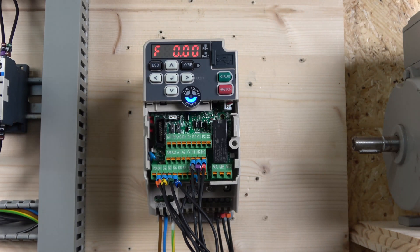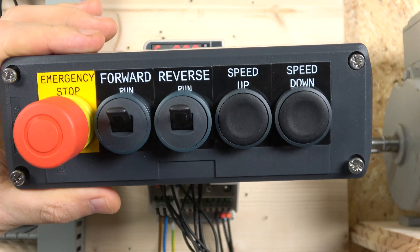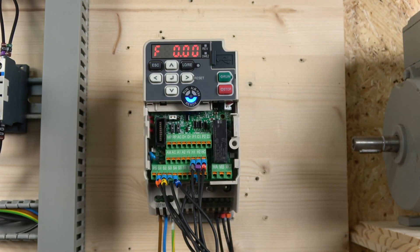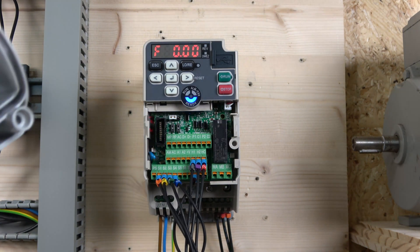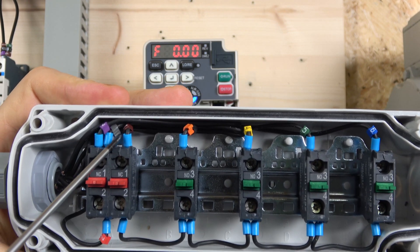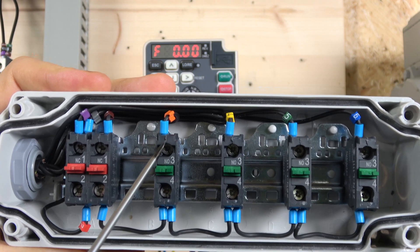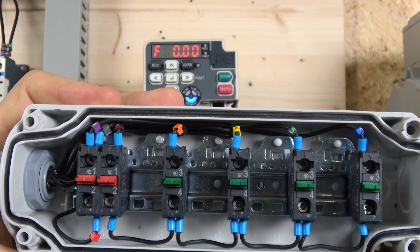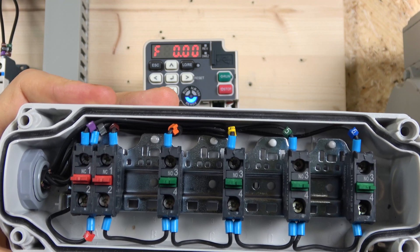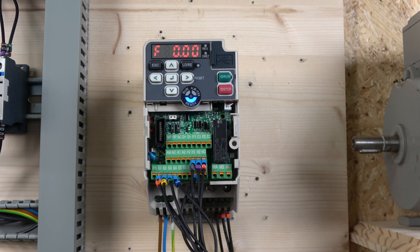Our first station for this video is MOP two up-and-down speed control. The station has: E-stop, run forwards, run reverse, speed up, and speed down. This setup is becoming quite popular. The wiring looks similar to the previous videos — HC, H1, H2, and SN as our power source for the buttons, coming through a normally closed contact and distributing power to all switches. S1 is run forwards, S2 is run reverse, S3 is programmed for speed up, and S4 is programmed for speed down.